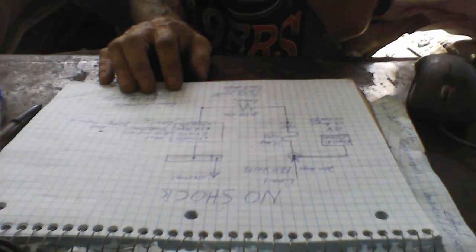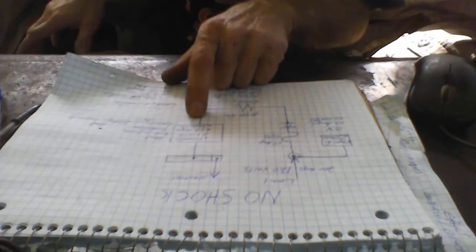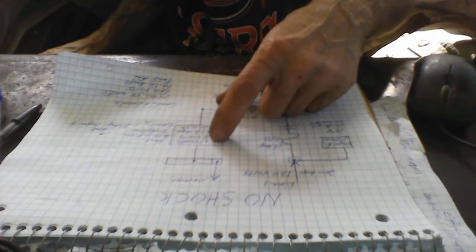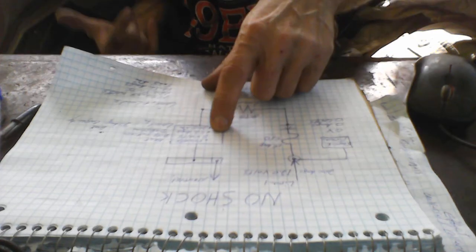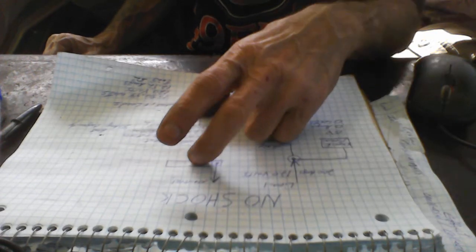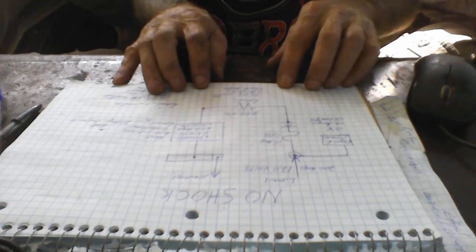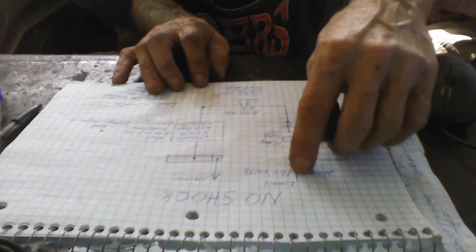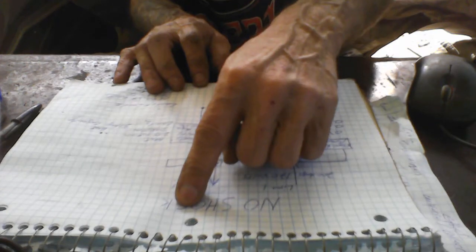And I would expect the same thing right here. If I put my amp meter right here, it'd be pretty much the same thing. This draws a little less than half a watt, so about a quarter amp, really, just about a quarter amp. So whatever's coming through is seeing most of the current going through. This is just drawing a little bit in and of itself. So when we short here, everything in back of this load is still dropping in current. The main current is going through the short and back up through my device and into PG&E.